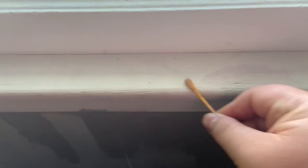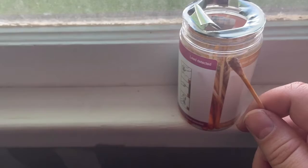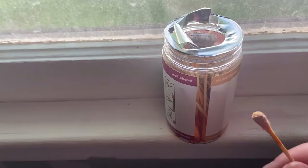This one room looks like an addition — everything feels a little newer in this room, so I'm not going to assume all of the windows are lead-free. That's about 30 seconds. So I can test it against the strip: if it's this color, there is lead detected; if it's this color, there is no lead detected. I'm going to call it no lead detected.